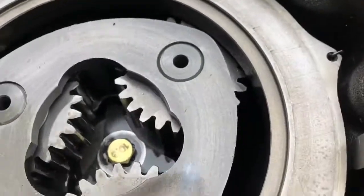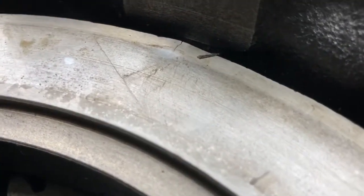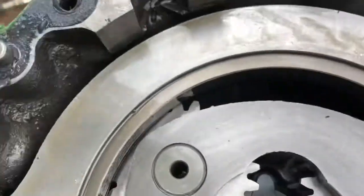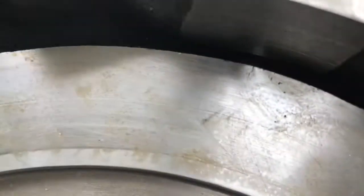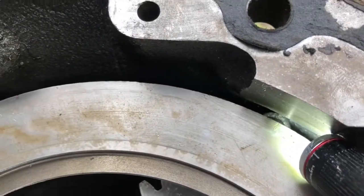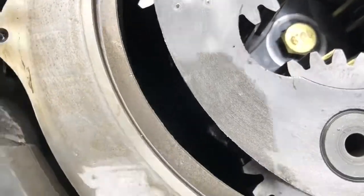Wow, look at that. I haven't even looked at this yet before I started filming, so I'm showing you things as I find them. The one thing I see is, there's a crack, and that's actually a bump, which means that this guy put this thing together wrong and something got stuck, and there's actually a ball right there in the hole, if you can see it. Can't really see it too well. I'll grab a flashlight for you. There it is. There's a little ball bearing in there, and that fell out. So the brakes were stuck in the lock position. Might have been one of the issues, but I'm gonna have to, like I said, take all this stuff apart and fix it, because somebody else did not do that.